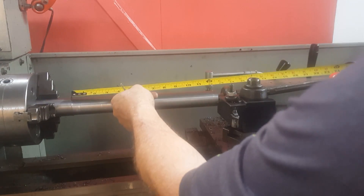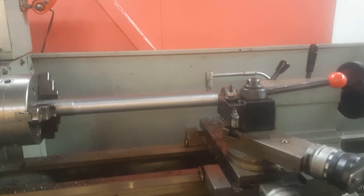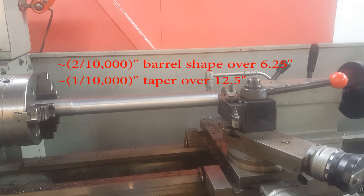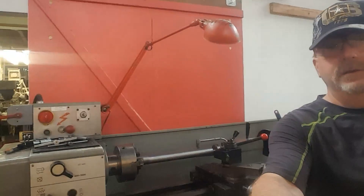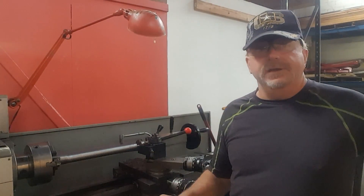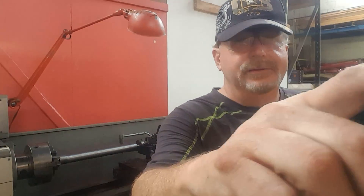The length that we tested was about twelve and a half inches. I'd say that's pretty darn good — tenths of barrel shape over that distance. I'm hoping this video will help establish that the lathe is in good condition and ready to go to work. This is Lucas, signing off on this nice old Colchester lathe.